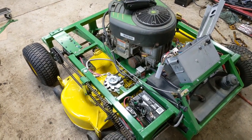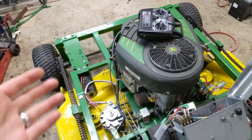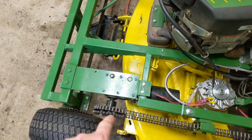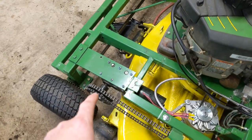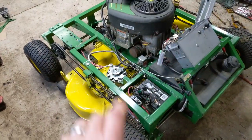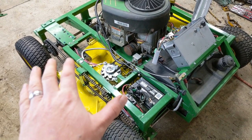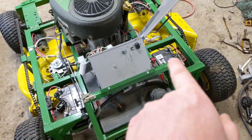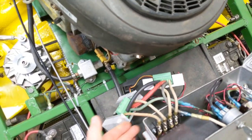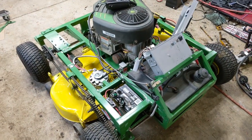In its current configuration, the mechanics of the drivetrain are actually pretty simple. It basically has a couple of wheelchair motors on each side, and they drive all four wheels mechanically with some chains. You can see there's actually supposed to be a chain from here to here — I have it off because I was doing some testing earlier. The second chain just comes all the way back and ties into this wheel here, so it's essentially four-wheel drive when you're working both motors. It's got a 24-volt alternator because the motors are 24 volts, and that keeps both batteries on each side charged. Then there's a couple of simple but pretty beefy motor controllers, and of course your controller and its transceiver. Not really complicated, but it is really cool.